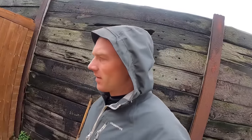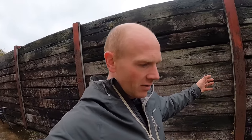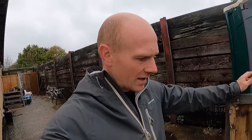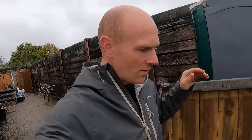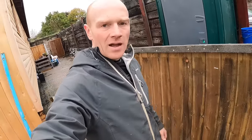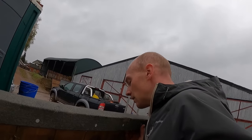I knew I should have pushed on yesterday while the skies were clear, but we're going to get this roof on. It made me think that another thing you learn when building a shed is how to move materials — it might be the first time you've had materials delivered, or dealt with full-size sheet material like plywood or OSB. The golden rule is try not to move stuff more than you need to. Think three steps ahead. I managed it on a sack truck, and another good way is to run a rope corner to corner to create a handle. There are lots of ways to carry big materials without heavy machinery, but there's always an element of elbow grease.